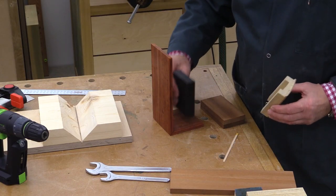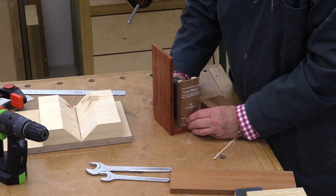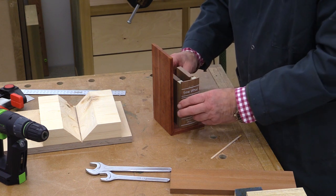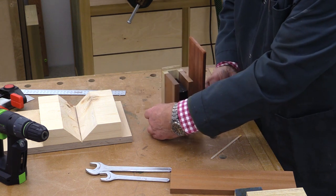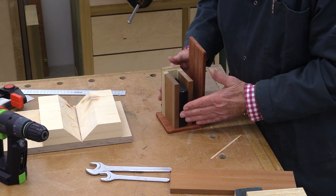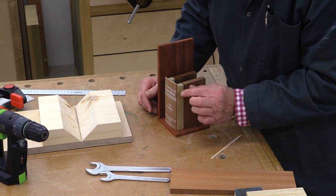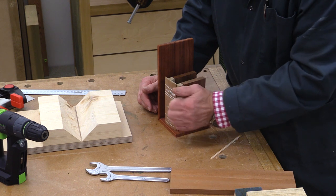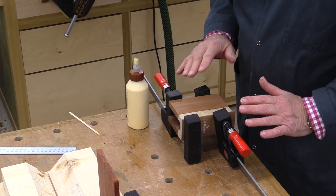This is the stage I'm at now. There's my weight, and there's my front piece with the channel - that's going to sit on here roughly like this. I now need a couple of side pieces, one at each side. I've cut them to size and I'm going to glue them on. You can see the weight is now contained within this space. There'll be a backing piece, and then side pieces which protrude at the front and will be rounded over to give the impression of the book binding and cover, which is normally creased at the edge. That's that glued up, ready to dry.